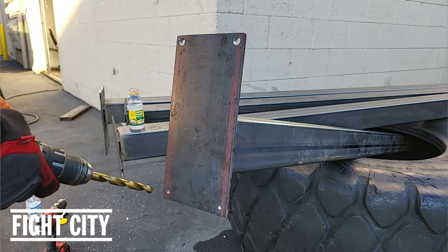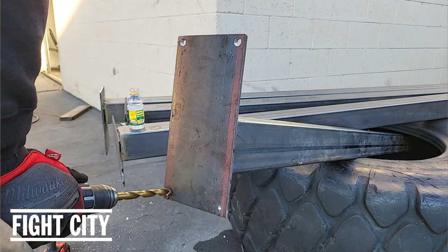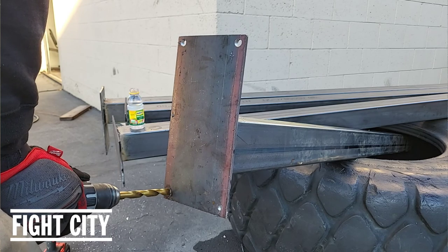A lot of people say use WD-40, but I like water. I've used them both. WD-40 seems to get into the chucks and lube everything up that I don't want to have lube. The water just keeps the metal cool and keeps the metal getting cut.